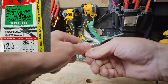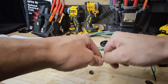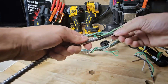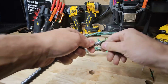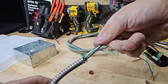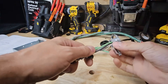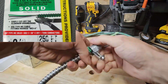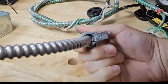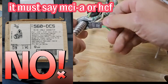The cable actually counts as a ground, and because the cable counts as a ground we have to use listed connectors that attach to it. So if we're installing this in a box, we would cut this portion off like this first — cut it back here — get all this paper out of the way. We need six inches of free conductor in the box, and of course we follow the regular wiring methods.